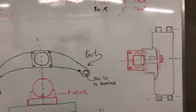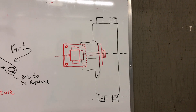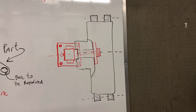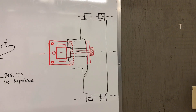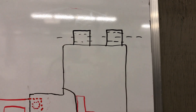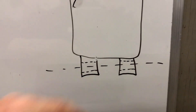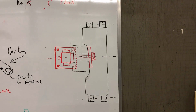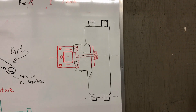The new idea was essentially what Max did: set these up on the lathe, hold a boring bar in the chuck and the tailstock, and line bore them. I also thought of mounting the part to the cross slide so I could bore one hole, then use the digital readouts to move down the right distance and bore the next. It was a great idea that would guarantee parallelism and spacing — but when I checked the travel on my cross slide, I was about a quarter of an inch short. I could almost reach between the holes, but not quite.